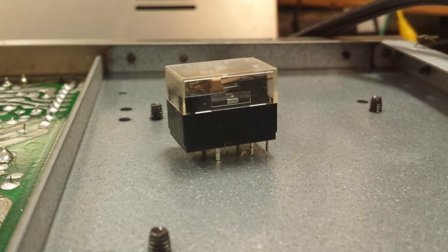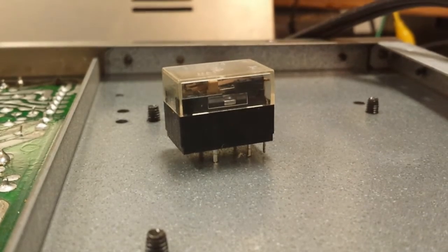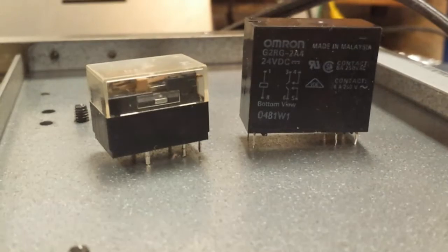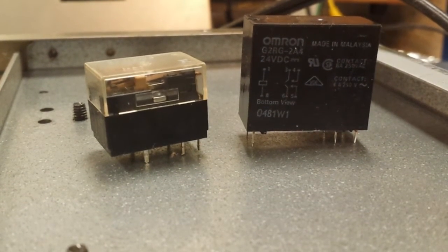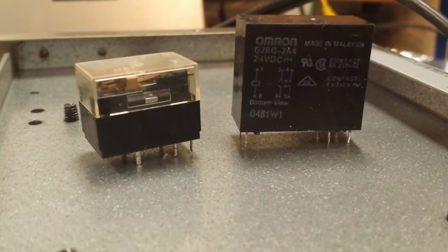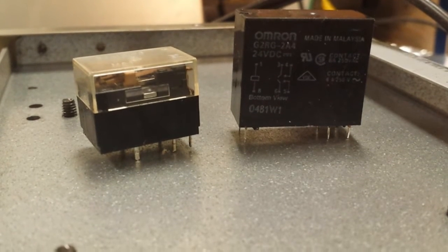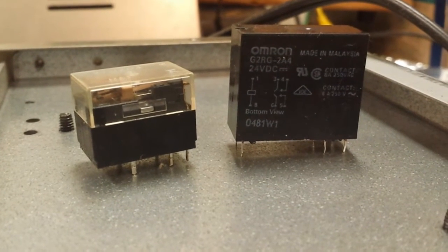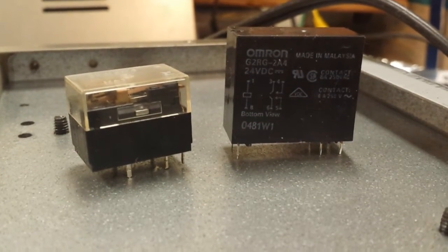The things that are important when replacing a relay: obviously form factor matters, and you wouldn't want something of equivalent spec since the equivalent was crap. What I want to replace it with is this big Omron 8-amp relay with a 24-volt coil, just like the original, but with much more power handling capability. It's hermetically sealed so we don't have to worry about moisture corroding the contacts, and this amplifier isn't going to put enough power out to kill those contacts.